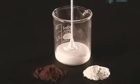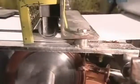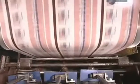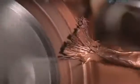Add a little glue and you've got friction, the material in the strip you rub the match against to make the head ignite. To make these striker strips, as they're called, a steel wheel rolls friction onto paper that's moving through a cutting press. This isn't the same paper from which the matchsticks are made. It's a higher quality non-recycled paper, suitable for colour graphics, because many clients order custom printed matchbook covers.